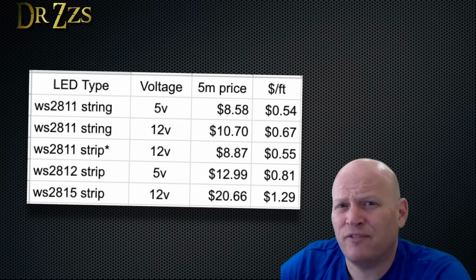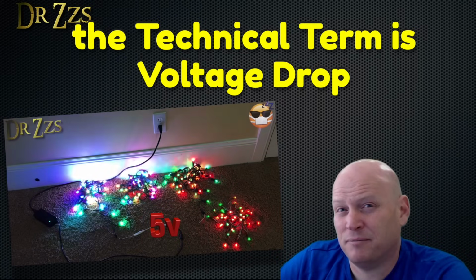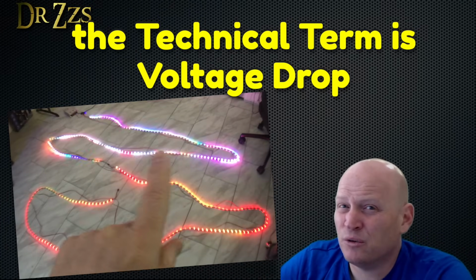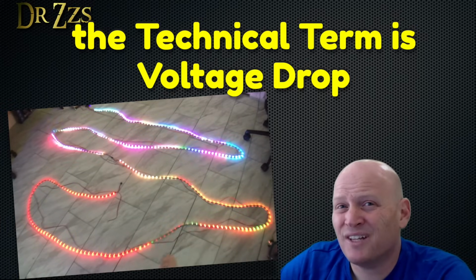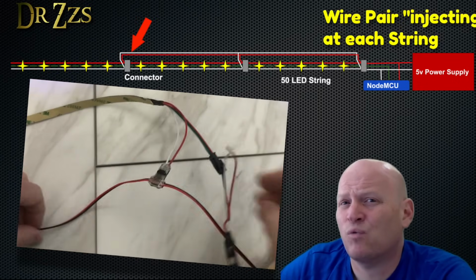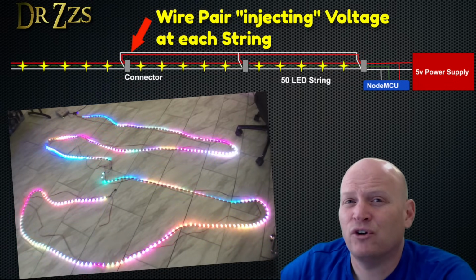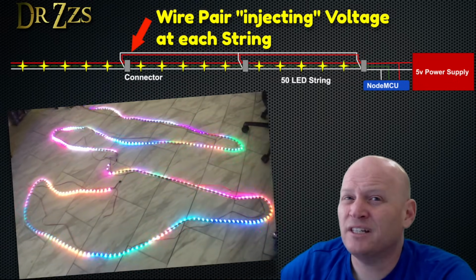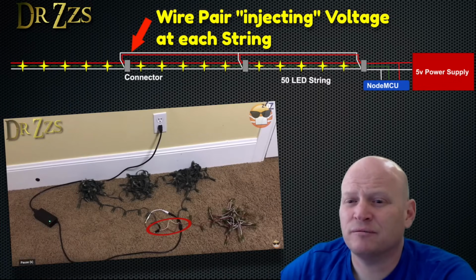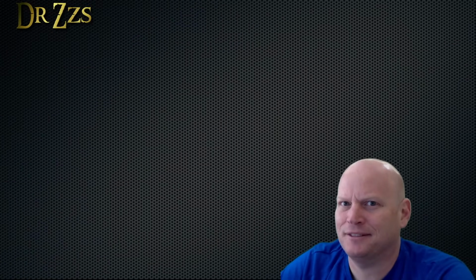12-volt strings are a little more expensive than 5-volt strings. The difference is about $2 per 5-meter string. The advantage of 12 volts is this. You lose a little bit of voltage with each LED because each LED adds a little bit of resistance. Eventually, the 5 volts that you started with will have dropped too low to produce accurate colors. The solution for the 5-volt voltage drop problem is to run a parallel set of wires from your power supply and inject power at each end of your LED strip or string. All of these LED strips or strings give you wires to easily connect to for injecting power. It's almost like they knew you were going to need to do this.